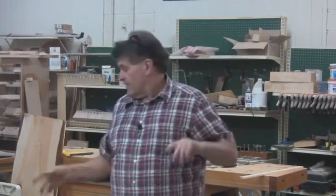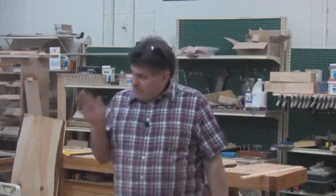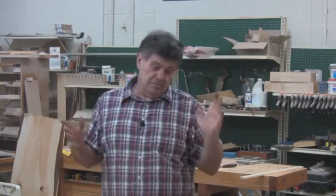On one of these, we're going to dovetail the top on, coming up to the sides. Through dovetails up through the top. We're going to put a molding around it. But for some guys, that could be a little bit of an issue, and it takes a minute sometimes. So on the other one, we're just simply going to put an inner top in it, then make another top that sits down on it and screws on. A little easier. All right?